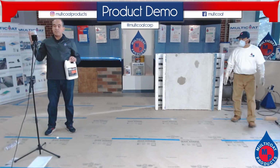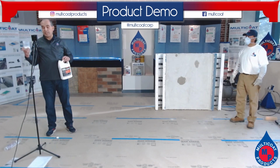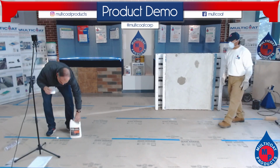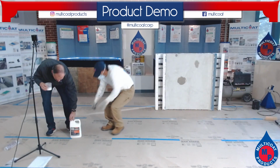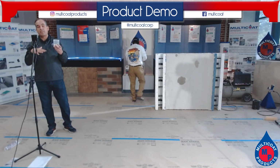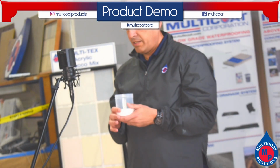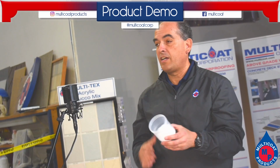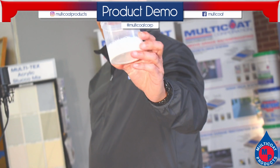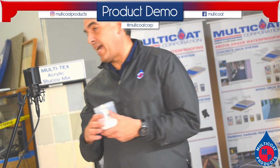So I have some baking soda here. Baking soda basically has alkali, just like concrete or shotcrete or gunite. And I'm just going to pour some product in here. And as you will see, it will basically penetrate the concrete. It leaves nothing on the surface. Penetrates 3 to 4 inches, as deep as 6. And what it does is it creates this gel that basically blocks 20 psi.